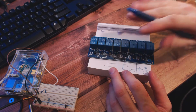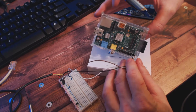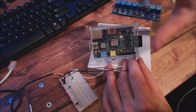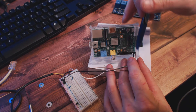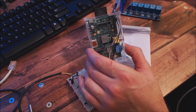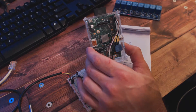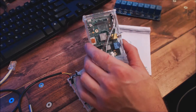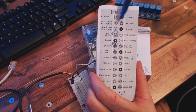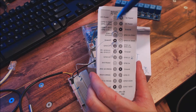Let's set the relays aside and get the temperature sorted out. Here I have my Raspberry Pi. Pin number seven is used, which is GPIO4. If you look at the Raspberry Pi pin map, starting at the top left — pin one, then two, three, four, five, six, and seven as you go down the line. I can show you exactly how that corresponds: pin seven, GPIO4, is the one you want to use for your temperature sensor.